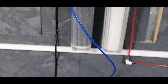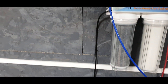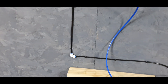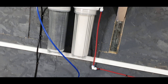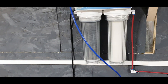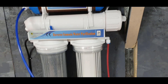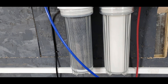The blue pipe is the output — at the moment I've just got that running into the waste. The black pipe is the waste, carrying all the impurities we're getting rid of, and that goes straight down the drain. Before you get an RO filter running properly you have to flush it in two stages: first you flush the pre-filter and carbon without the RO membrane in place, to get out any dust — carbon can be quite dusty — so it doesn't block up the membrane.